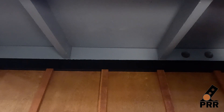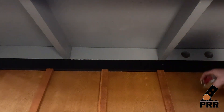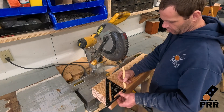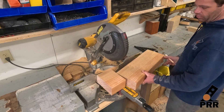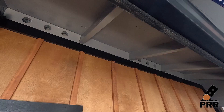If you decide to install your patio roof risers into blocking, the first step will be to measure the space between your rafter tails and then cut your blocks to size. Take this measurement for each block individually, as rafter spacing can vary. Now measure and mark the width of your block on your rafter tail.